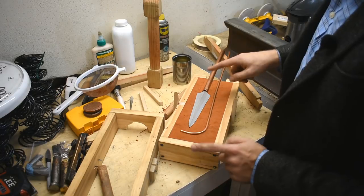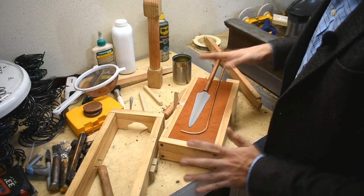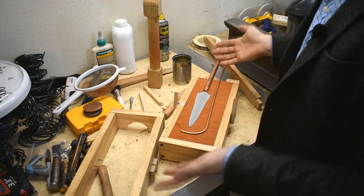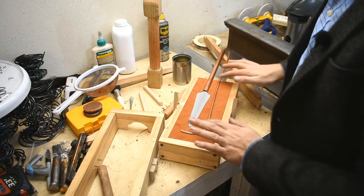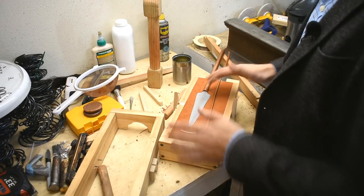I am going to cut it a little bigger. I'm also going to preheat this sand this time, to hopefully allow the metal to run in, fill up, and not solidify anywhere. I'm going to use a torch for that. This is vertical — a little different setup than you would traditionally see bronze spear points cast in.